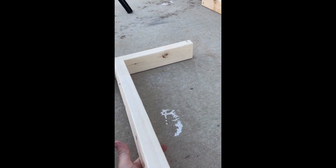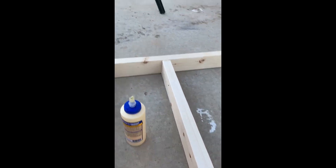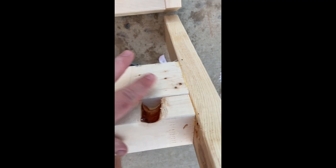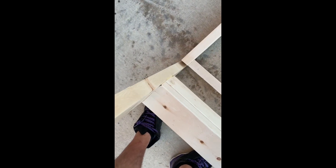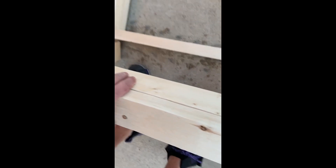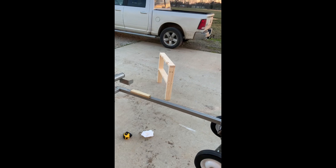The brace board is one of your 25 and a half inch boards and it should fit perfectly inside. After you get the braces on, attach another 25 and a half inch board right snug underneath the brace — square it up on the edges, it'll be a tight fit. Use a hammer to get it where you want it, put two screws in, make sure it's well glued. This is structurally important as this is where your frame is going to screw into.